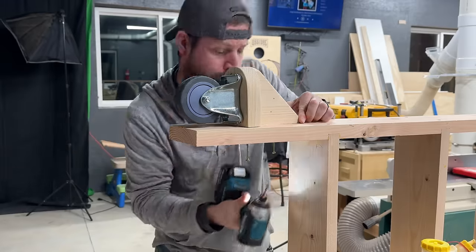The first trial run of this ladder actually worked out better than I expected — it rolls nicely and works as expected. The one minor tweak I need to make is how it's captured to that upper rail. Currently it relies on my weight and the natural angle of the ladder, and I think the lower wheels are slightly misaligned because it wants to roll in an arc, which forces the leading roller at the top to work its way away from the rail. I found that if I just roll into position, climb up, and then climb back down, it works as intended — but if I decide to ride the ladder down the rail, there's a chance it might derail and ultimately kill me. Here it is in all of its massive glory.